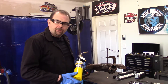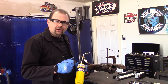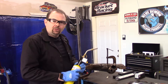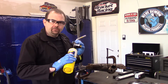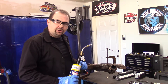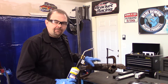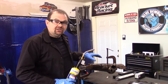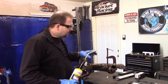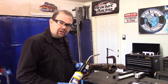We're back from padding beads — comfortable with arc length, amperage, and everything. We're getting ready to weld on the exhaust manifold. I'm going to bring it up to temperature, then make one full pass all the way across. I fully expect there to be some porosity that I may have to grind out, or maybe some underfill. Cast iron is not the easiest metal to weld, so with that in mind I'll preheat this and bring you back for an arc shot in just a second.